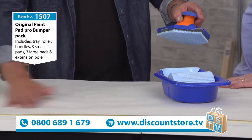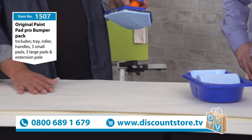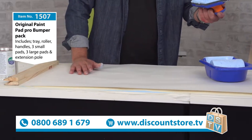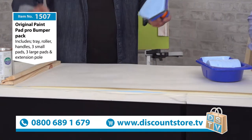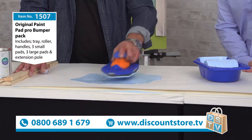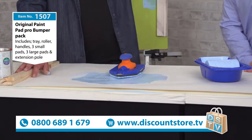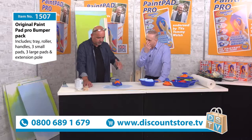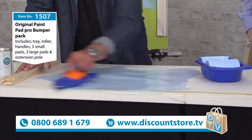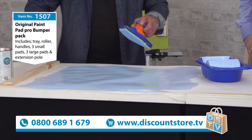If it's a flat surface - this represents a plastered wall or lining paper - this works great for different surfaces. The biggest problem with paint rollers is that when you apply the paint you're rolling it, so you're left with a stipple surface. If you want a true flat finish, don't use a roller. With this you just glide it on, and when it dries any lines disappear - it dries like flat porcelain.